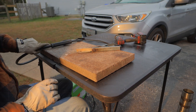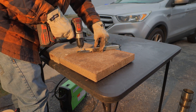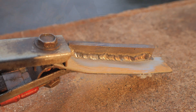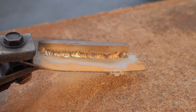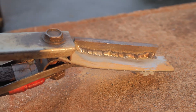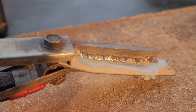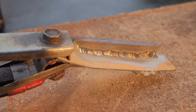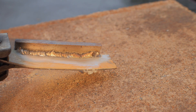As you can see, you can definitely control the puddle with thicker stuff. Thin stuff, you gotta be careful. Not horrible. I think I can turn the heat up a little more, so I'm gonna hit the backside. I don't think we can do the E on this because you really want to stick it right in the corner and turn the heat up so it gets good penetration. I think I can get a little more penetration with a little more heat. Let's try the backside.